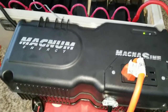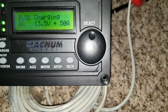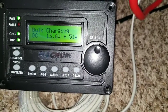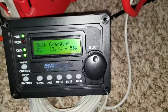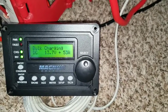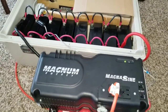Listen how quiet the fan is — so quiet. It's not like the big machines that make a lot of noise. It's ramping up RPM because it's now bringing about 45 to 50 amps on a 50-amp breaker outlet, charging the batteries. We need to get up to about 14.4 or 14.6 volts. That's the update for you guys — subscribe, share, and give a like.